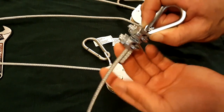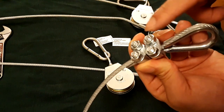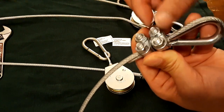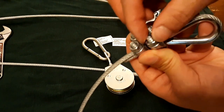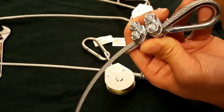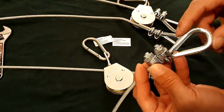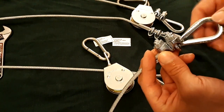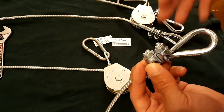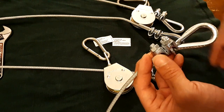After that, I repeated the process with the outer wire clamp. Make sure you alternate left, right, left, right, and tighten them alternately, because if you tighten one side all the way, it'll rotate. So make sure you tighten these screws evenly and then double check at the end. These thimbles are really just to extend the life of the cable itself so the cable doesn't come in direct contact with the carabiners, because that would cause the coating to wear off faster.